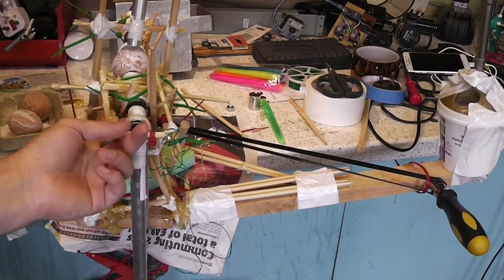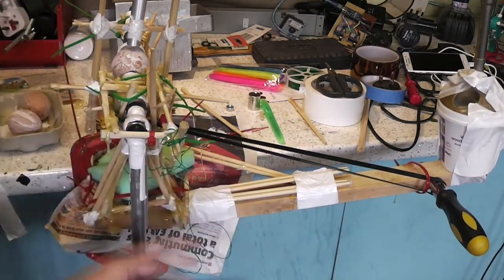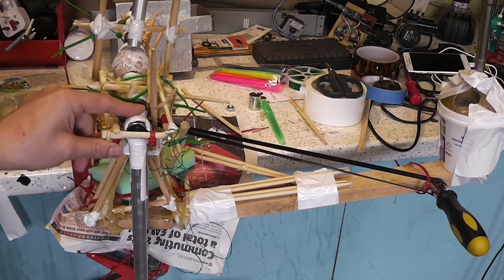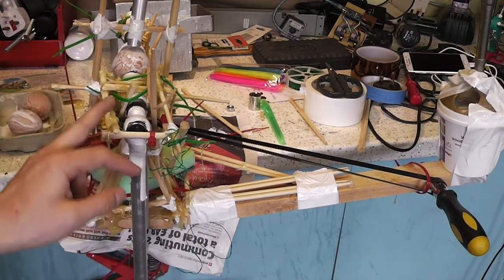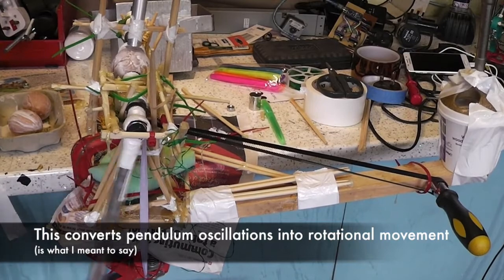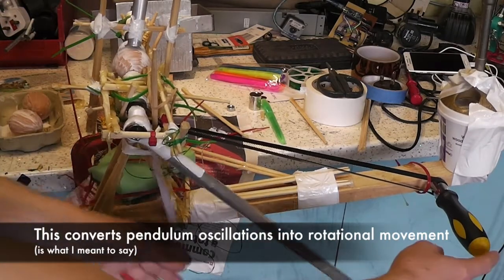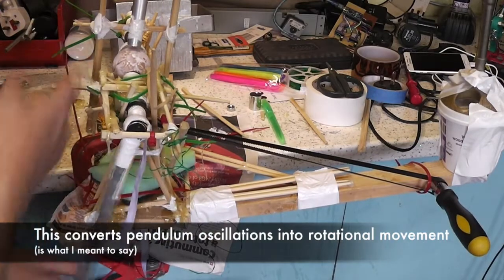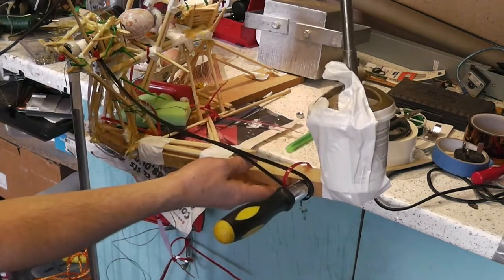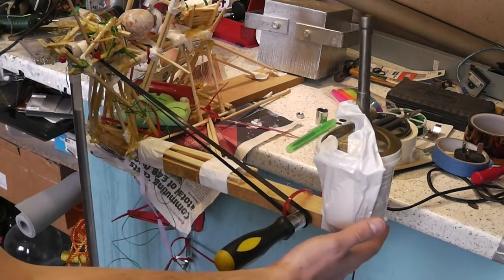The wrench is connected to this two-direction ratchet screwdriver via this timing belt, and the ratchet on the wrench is set to the opposite direction to the ratchets here, which means that as you turn the pendulum, first that stops and prevents this whole part of the mechanism, which is on a kind of hinge. The idea is to try to adjust the tension on that belt using the weights on the end of that arm.